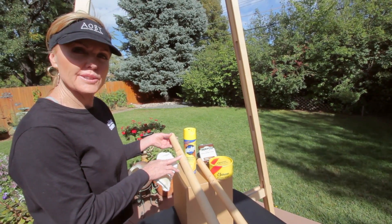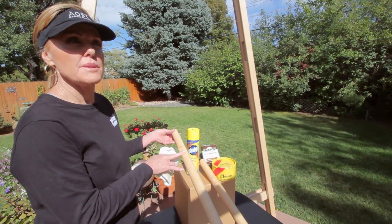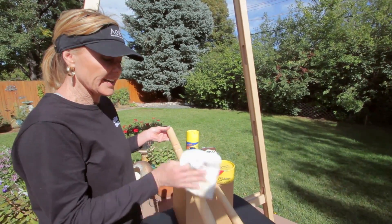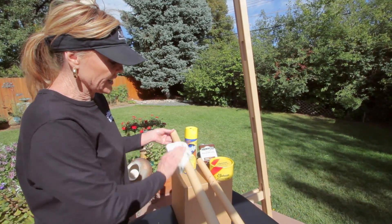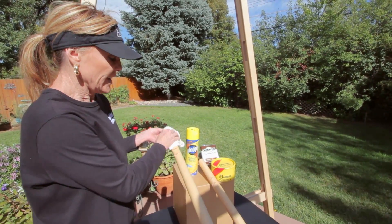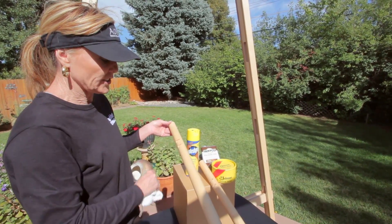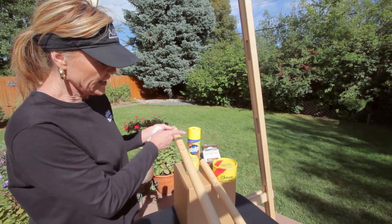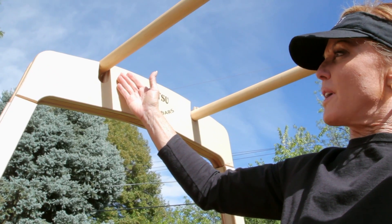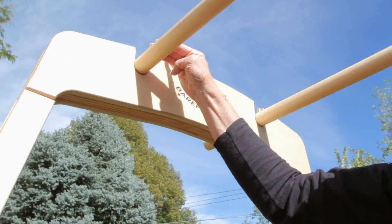Just a little tidbit about your handrails — your handrails come to you unfinished. We don't want a lot of build-up lacquer on them because when you handle them with your hands it would get adhesive and sticky. So we try to keep your bars as natural as possible. What I'm doing here is I've got a little bit of Johnson's floor wax on a rag and I'm doing another sealer coat. The wood is coarse and it's going to suck up anything you put on it. Danish oil, Pledge, Johnson's furniture wax — any kind of oil will do. When we get ready to drop our handrails in, simply line them up across your headers and they'll slide down inside the notch.